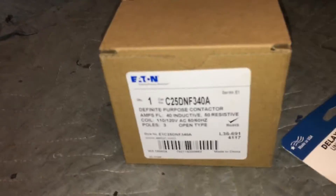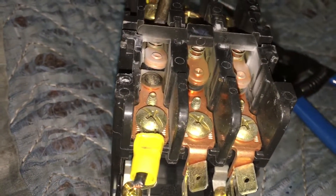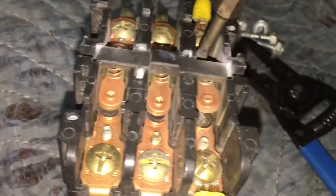I'm going to put in a time delay, new contactor. Out with the old contactor. There's the points on that one — pretty much gone. Those aren't bad; that's the compressor. This is the compressor contacts right on this side — that's what I'm most concerned about. That one's gone. Out with the old and in with the new.